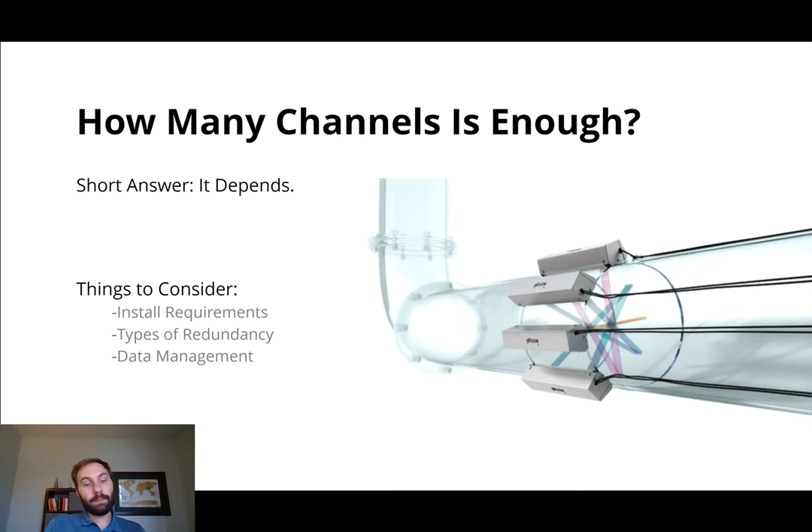When you're looking at these different applications for BTU measurement and asking yourself how many channels is enough, it really does depend. For places like data centers, they require a lot of redundancy. If you're in a location where this is a critical application, you want redundancy, or if you want to measure a lot of pipes. Sometimes using the quad beam to measure four different pipes can be more cost effective than four different meters. Sometimes when you have four beams shooting across the same path, as you see here on the right, you don't need as much straight run, because the accuracy — you're measuring each beam against the other beam — and the flow computer can do some complex math. But for most people, a single-channel energy meter, a 502TE, is going to do just fine. There are applications where you would need more.